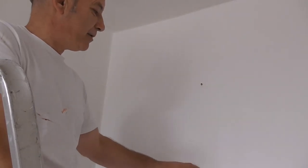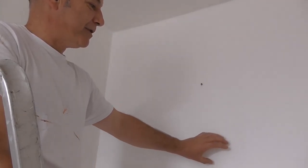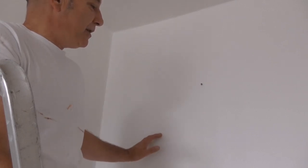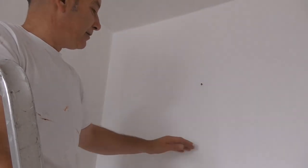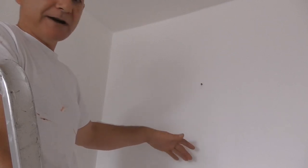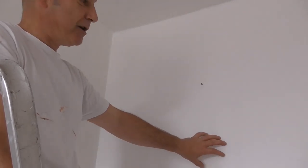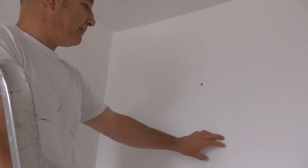By pinning the plaster first when you cut out, it stops any more fracturing as you're chiseling out. You could take the plaster off, take it all back to the brick, repair all the mortar lines and then re-plaster, but that is a long job — it's a big process. If you wanted to do something quite small and localized and generally there was nothing wrong with the surface, then yeah, just patch up.